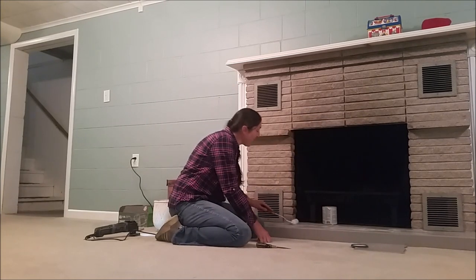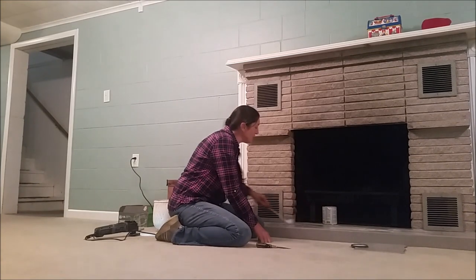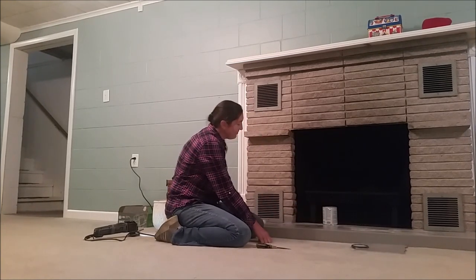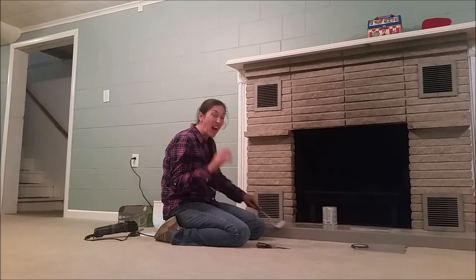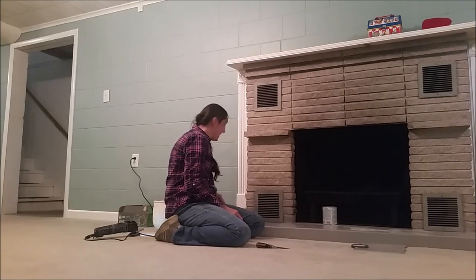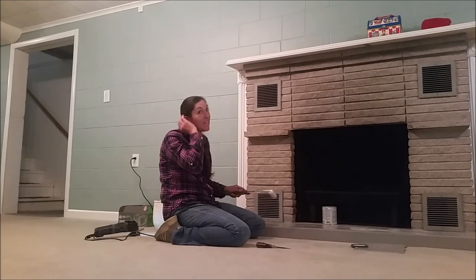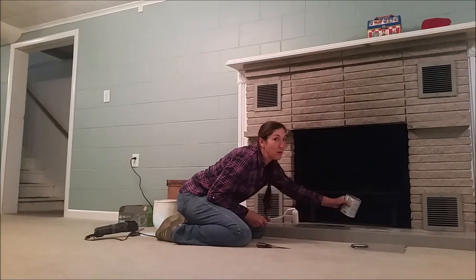But I'll tell you, that backfired on me the other day. I was working on the kitchen countertop and I poured it out. I thought I got it spread out pretty well. It was too thick and it started to crackle and have like an old-fashioned finish on it. I had to sand that whole layer off and it took days to dry. So I sand a little bit and then sand a little more. So use caution when you decide to do this because it may ruin your project.